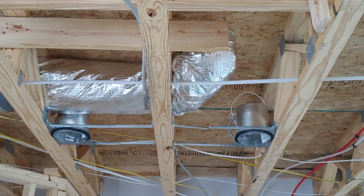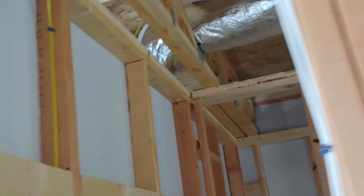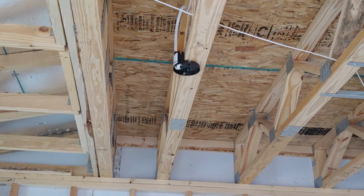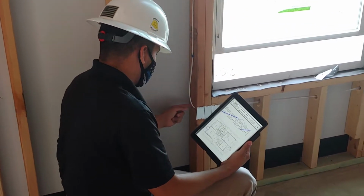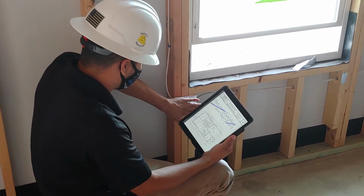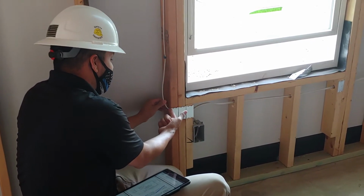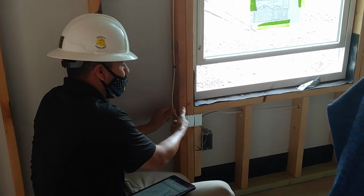That's the one coming up from that bedroom area that I mentioned earlier, coming into the front. This is really meant for structure, like the front room here. It just adds resistance. A ceiling fan can go in this area. So it comes up past half of the 2x4. We're going to add a plate carrier, a nail plate, so that if the drywall guys try to put a screw or something through here, they don't nick this. That's going to prevent that. If they nick this, this switch won't work.